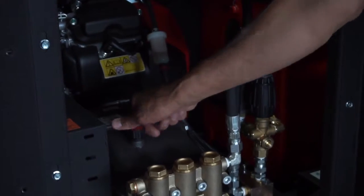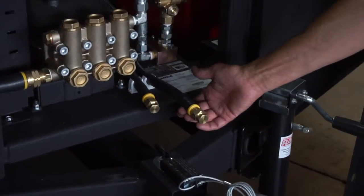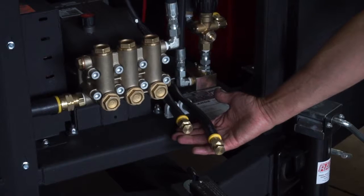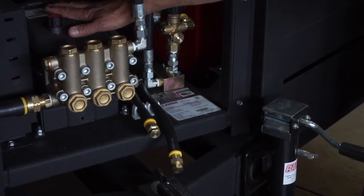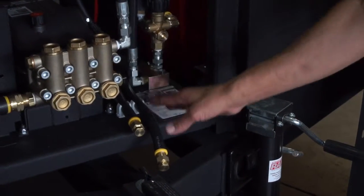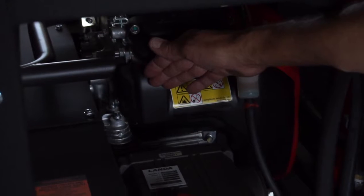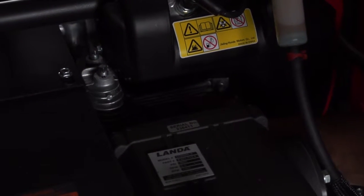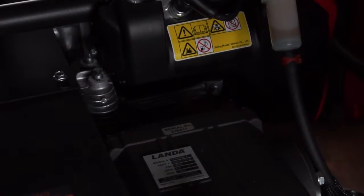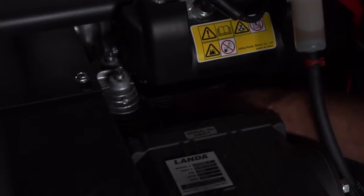When maintaining the LT6036L.2 pump and draining the oil, there are two drain hoses at the front of the Eco 7000 wash trailer. One hose drains the oil from the pump when it needs to be changed; the second hose drains the oil from the engine. Directly behind the pump, between the Honda GX660 engine, is an oil filter that is very easily accessible from this front panel location. When changing the oil in the GX660 Honda engine, it is important to remove and replace this oil filter at the same time.